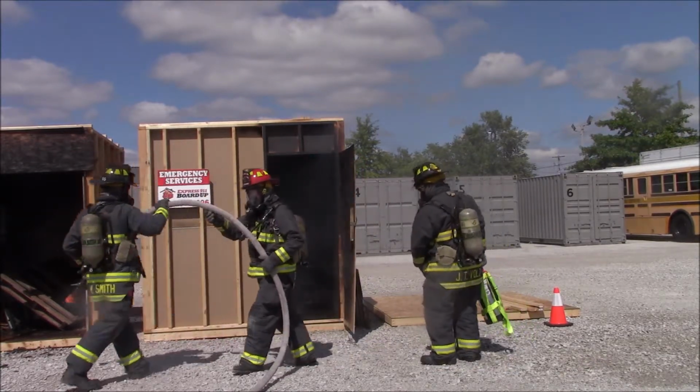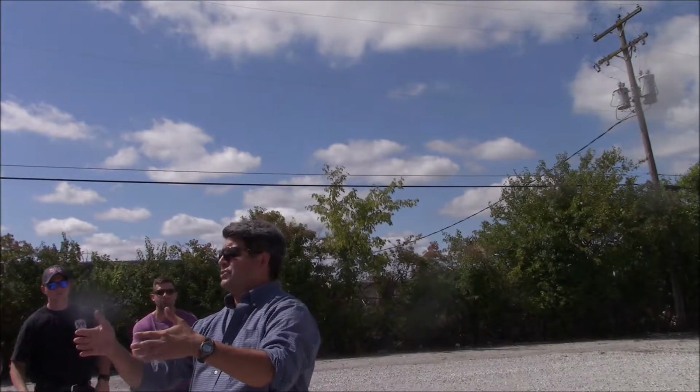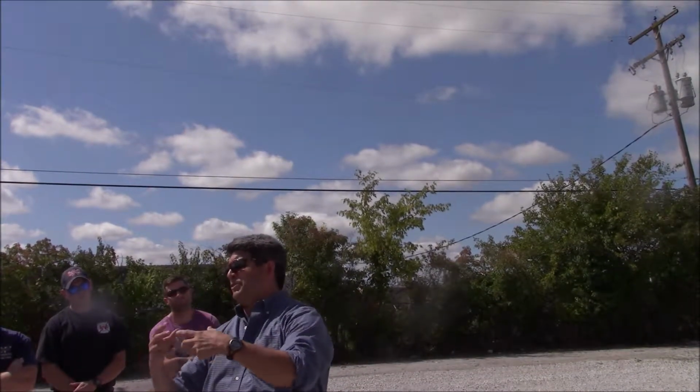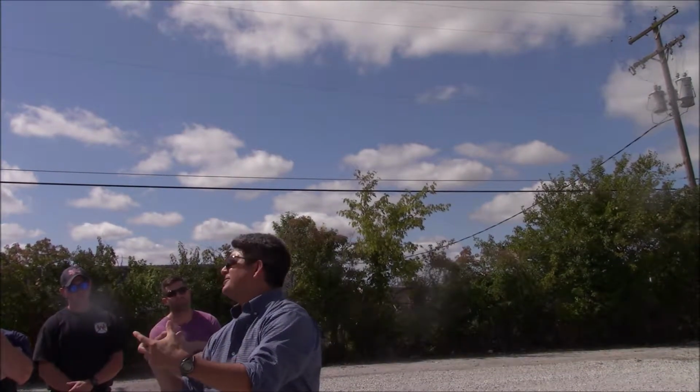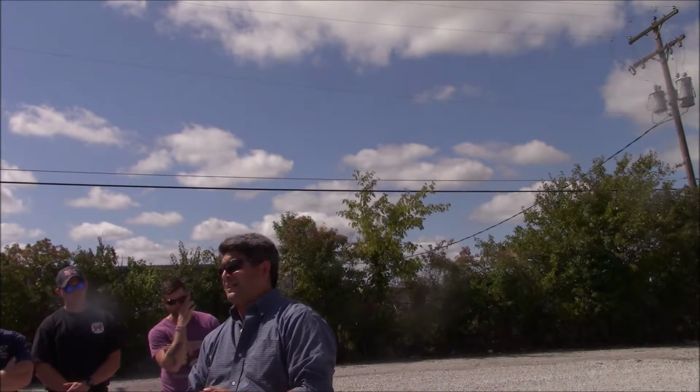Yeah. Now another thing to take from these demos, right, is these are content fires. They're not structure fires, right? So once we start having the fire breach the drywall and get into the building construction members, it's going to take a little more water and much more extensive overhaul to get it. But content fires, generally speaking, should be pretty basic bread and butter affairs for us.